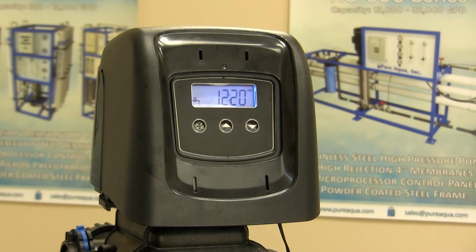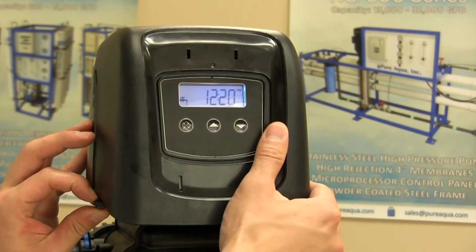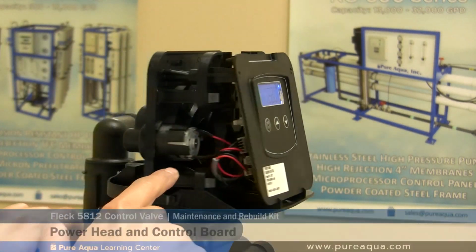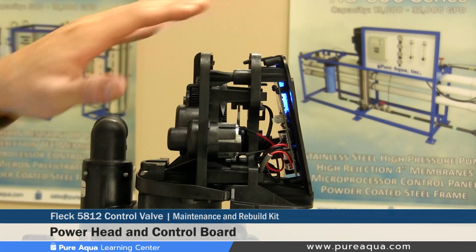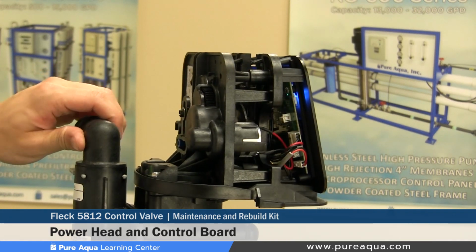The 5th section of this tutorial video will cover some preventive maintenance tips along with Pure Aqua's rebuild kit. So to begin with the valve body here, a few things that can be replaced maybe annually or every 2 years would be the power head and control board. These have a lot of moving parts and electronics, and if these are replaced before they fail, it would prevent any downtime for each application.